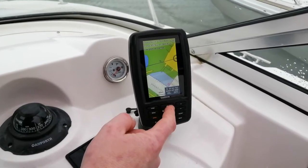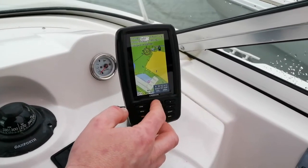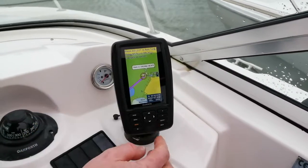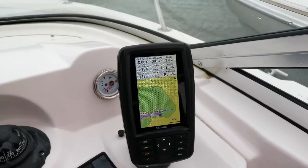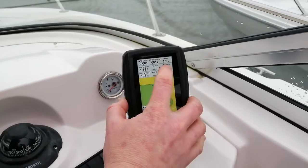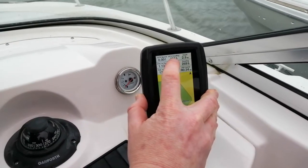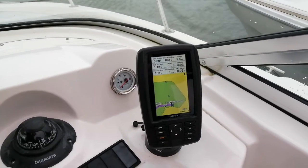It's difficult to see where the corner is exactly. We know that when we get down here we've got to go to the red and green buoys, but this particular chart plotter doesn't actually show those red and green buoys. Pressing select there, and the last select button back down at the marina — you have to go through the green to get from the marina as you can see. If I press menu and navigate route, it gives lots of complicated numbers. The most important is the bearing to the next buoy — if it says 279 or 269 degrees, that's where I need to steer on my compass to go in the right direction. It tells me my GPS heading — that's the way I'm actually going — and the way I want to go, plus the distance to the next point or destination.